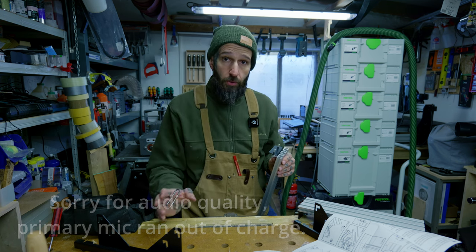That's both panels done. Let's loosely fit them into the tracks. It's telling me to make them flush on a straight surface, so I'll use this bit of wood — just a simple bit of construction lumber — to run the brackets flush to the panels, and then tighten them. It gives me an approximate level. I'm threading them diagonally — four of them — so I'll go diagonal, then diagonal again when tightening, and give each bolt that little extra quarter or eighth turn at the end.